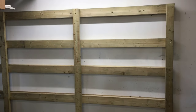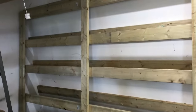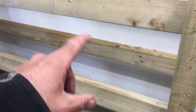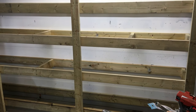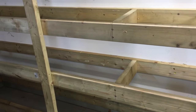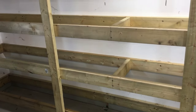That's all the legs on now. I've just put them on, trimmed the tops, and now we can release this frame and pull it away from the wall. That's it released from the wall, so this is basically floating now. What we need to do now is determine the depth - I'm going to make it 500mm, which is basically half the width of a sheet of ply, just under half, just to maximize the amount of material we can use. So that's the front brought out from the wall, I've put in end pieces here, and I've put noggins in at the end as well. The next job, I think I'm going to put the plywood in next and then put support braces in afterwards, just in case I can't get the plywood in - I might have to feed that through the top.